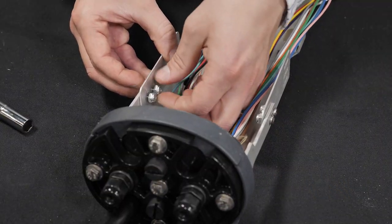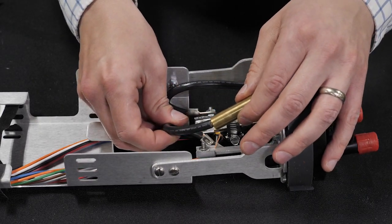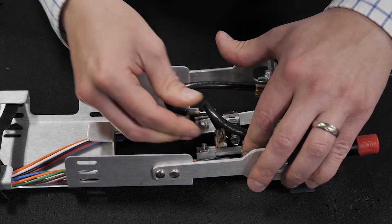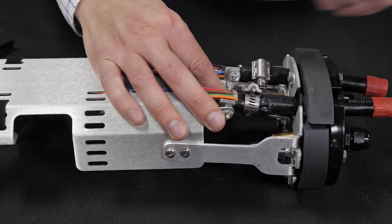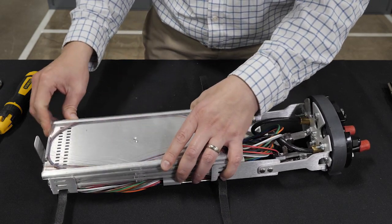Reconnect the platform and cable seal assembly after installing the cable butt ends into the seal. For isolated ground closures, connect the number 6 cable to the shield bond connectors installed on the cable. Route excess buffer tube storage under the splice trays and install the splice trays into the platform.